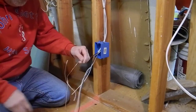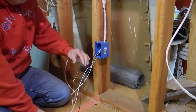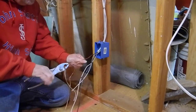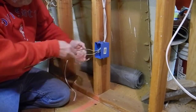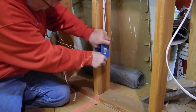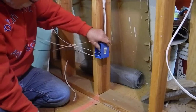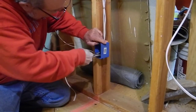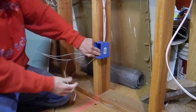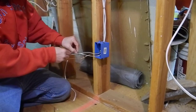Let's cut all this weirdness off. What's nice about this — if you want to go add something, you can get two in and working. So you could take this, shove it way in here like that. It's already not insulated anyway, so you can be rough with it. What we're going to do is leave this in a nice location so it'll hook right to our ground lug right there. Okay, next we're going to do the neutrals.